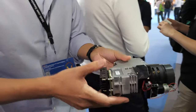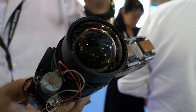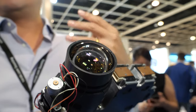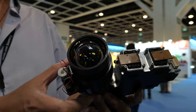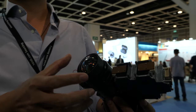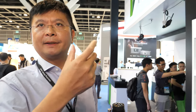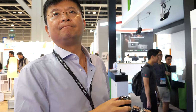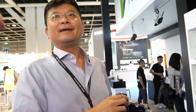Is it 4K? Sure, a small projector. So how do you make 4K work? With DLP, you need a kind of optical component to enable the 4K. So what special optics is required for 4K? Actually, it's an oscillator. With the DMD chips and a special oscillator, the resolution improves. Is that part of the optics? It's part of the whole system: the chips, the optics and the whole system. When I did the videos with TI about 4K, it sounded so impressive that they could save cost by oscillating. Yes, exactly. And it's impossible to see the difference between native 4K and oscillating 4K.